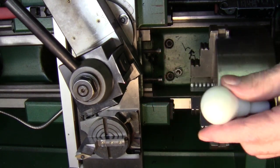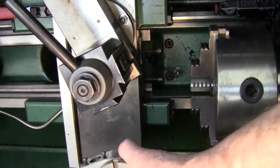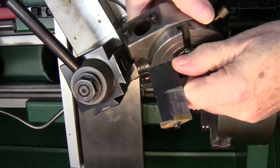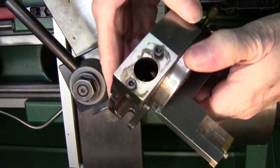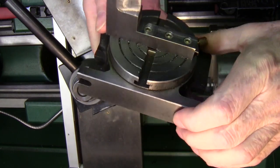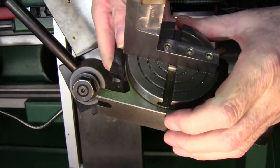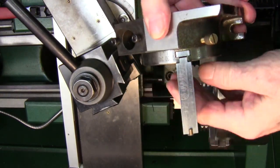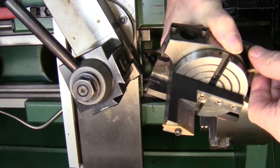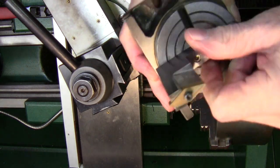In this video I'm going to show you how I turn the handle for these hand pieces and the tooling I use. I modified a small rotary table that I got off eBay — it's a 3 inch rotary table. I had to do some work on it; it was kind of sloppy when I got it, but I was able to tighten it up. Now it's hanging pretty tough. I pulled out the little dial that came with it because that was pretty useless. It works pretty good now, and you can get these off eBay for around $90, or around $50 shipped from India.